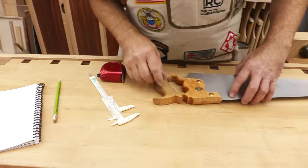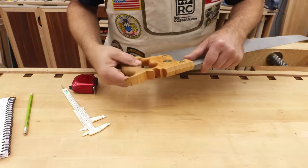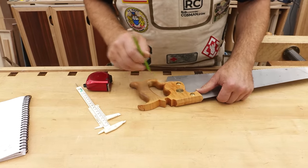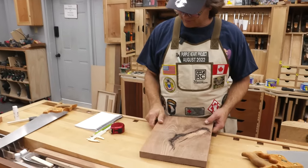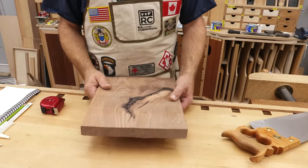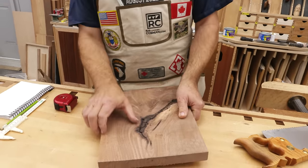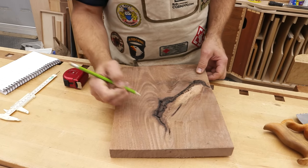We've got to actually draw that shape and it's going to be a little bit tough because this is rounded over, so it's not like you can just put your pencil down in there — it's going to be hard to follow that. We may do a little bit of shaping to get it just right. This was the end of a walnut board that was ten inches wide and had a big old bark inclusion in there, so it wasn't going to be useful for just about anything, but I can get what I need right off of there. I'm going to take that over to the band saw and rip it right about here.